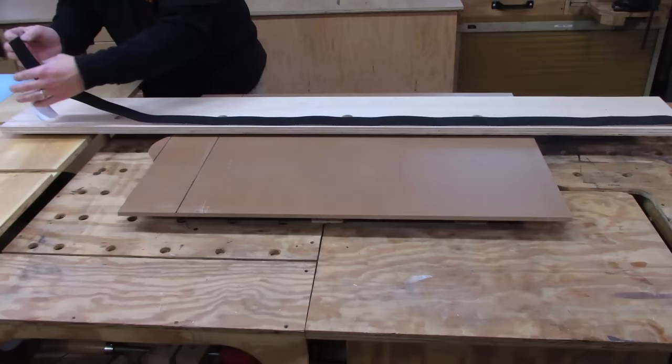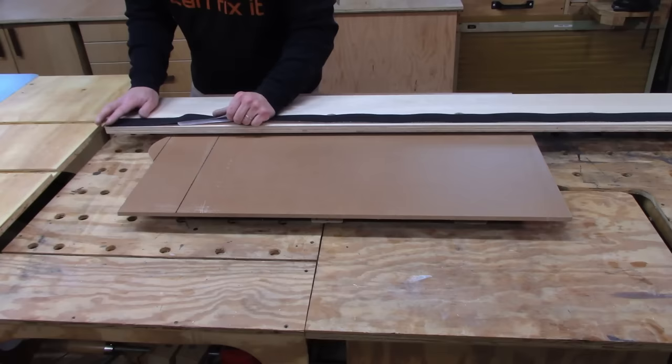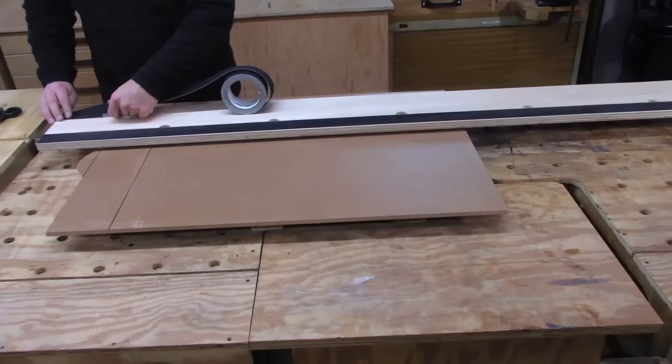I'm applying non-slip tape to the bottom of the jig so it won't move around during use. You could use self-adhesive sandpaper or even skateboard tape. If you can't find it locally, I'll put a link below where you can order it online. I like this tape because it comes in a long roll and it won't have any seams to get caught as I'm placing the track saw down for a cut.